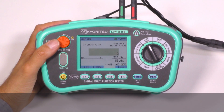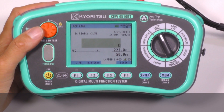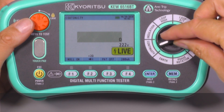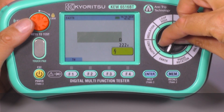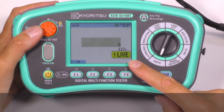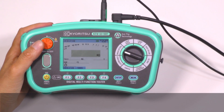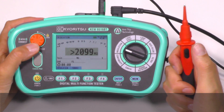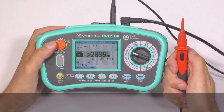Safety 1. The live circuit warning with electronic protection is available for insulation, continuity and earth measurements. A large warning symbol blinks on the display and the test will not start. Safety 2. The remote probe or the lockdown function of the test button allows hands-free testing.